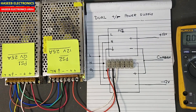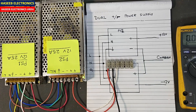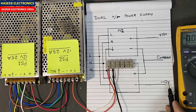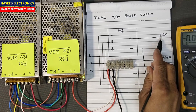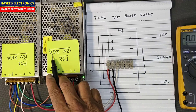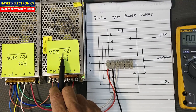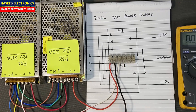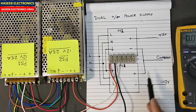In this way we can configure any power supply — whether it is 12 volt, 5 volt, or 15 volt, whatever the value. The amount of current available is negative 12 volt at 25 ampere, which is the capability of this power supply, and positive 12 volt at 25 ampere. We take the positive voltage from here, negative voltage from here, and the common point is the jumper between the positive of PS1 and the negative of PS2.